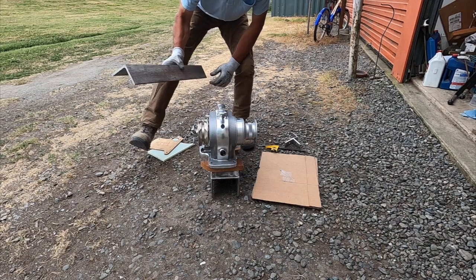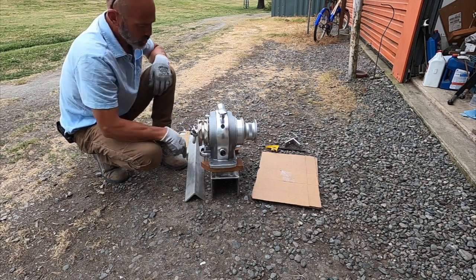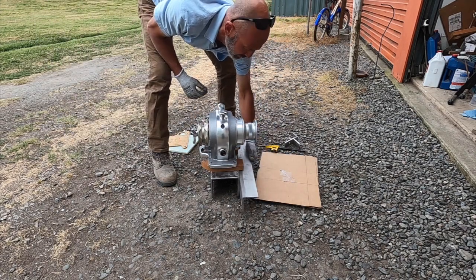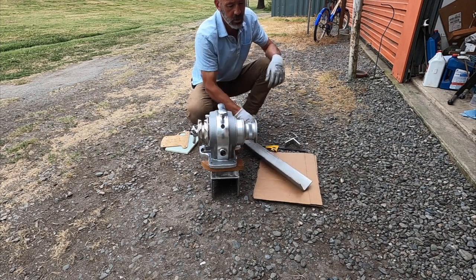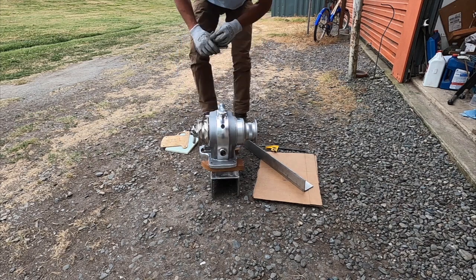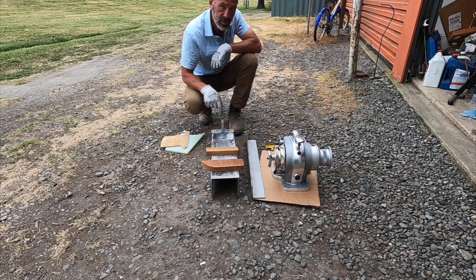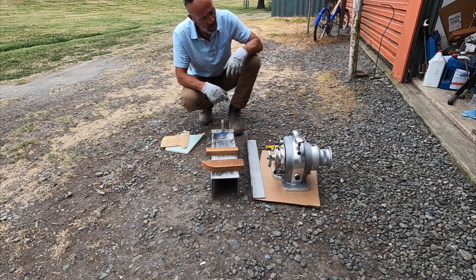Then I'll have long studs welded to the plate. I've got some stainless steel angle — the whole bracket is 316 stainless. I'm going to cut some short pieces for the bracing and for the through bolt on this side of the chain fall. Also, I have enough of this to cut two pieces and weld them back to back to create a tee piece. That's going to go on the back of the windlass bracket right here, extending out about four inches into the inside of the Samson post. Between the Samson posts is where the tab for the inner forestay will go, and there'll be another hole back here for the tack pennant on the staysail.